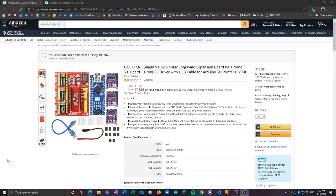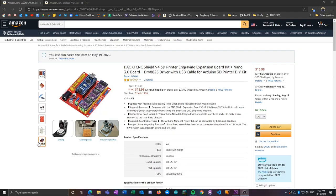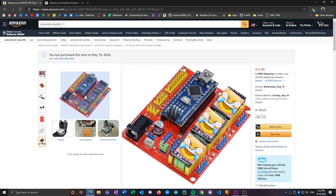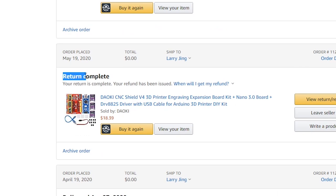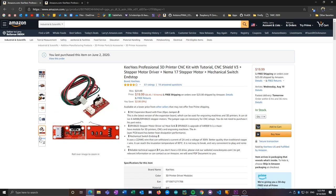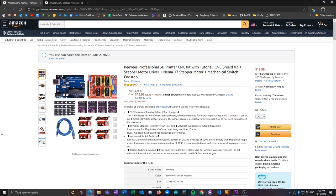For control, I bought an Arduino-compatible CNC shield, and when I powered it up for the first time, I followed the Amazon product image to see how to orient my stepper drivers, but the Amazon image from the purveyor was incorrect and I ended up frying the entire board and burning my hand. I needed to buy a whole new board, and this time I checked every connection with the multimeter to make sure the exact same thing wouldn't happen, and it worked, so that's nice.